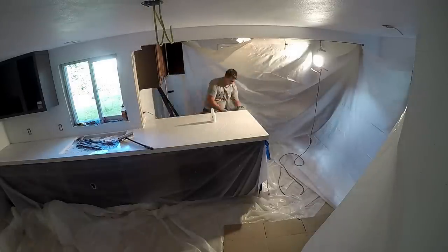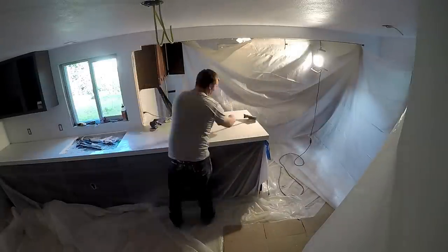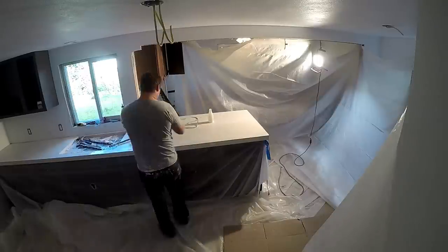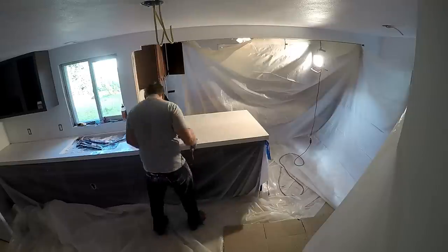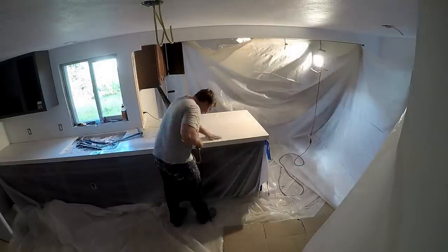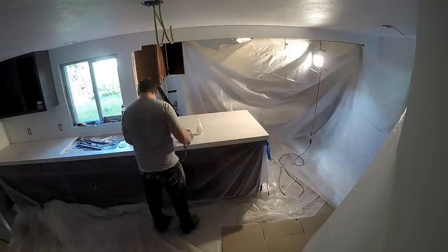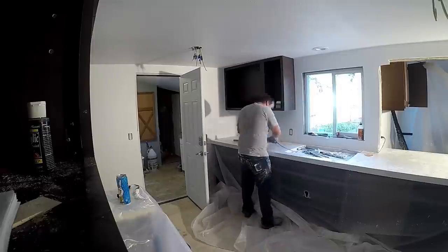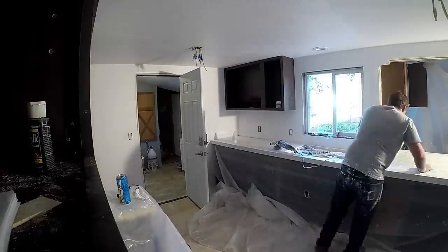The outer part of the mold breaks off and the underside stays up underneath. Then you get to do some polishing. I used one of the eBay diamond polishers — it came with an assortment of diamond pads and worked really well. It had a water injection port but I just used a water bottle to wet it out so I wasn't flooding my kitchen. I started with 200 grit and worked all the way up to 3,000 grit to get a complete polish on the countertop.